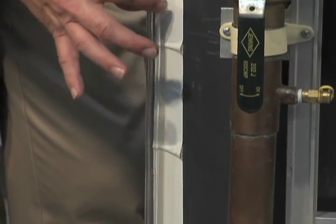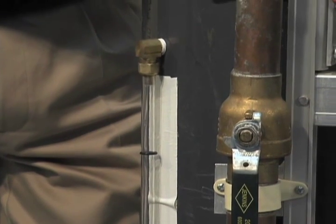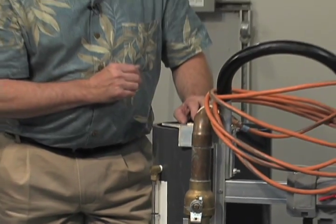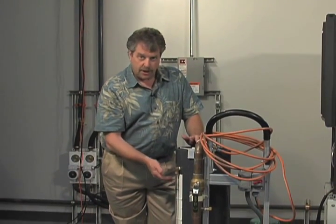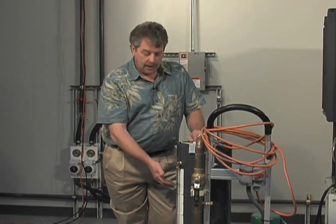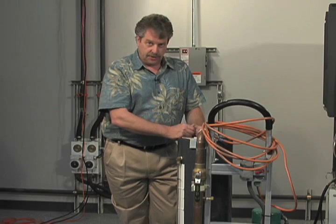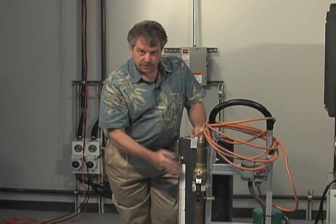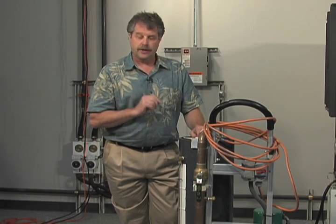We'll actually move this O-ring to the fluid level, and one of the steps that is frequently missed by guys out there flushing is they don't go through the verification or a compression process, pressurization, to see if we have air. So if we have much of a fluid drop here during a deadheading process, we'll see it in the sight glass. It's difficult to look inside a vessel and determine how much drop there is, but when you put an indicator like this at the fluid level, compress it, and see what kind of drop, you get a good measurement as to whether you've gotten all that air out successfully.